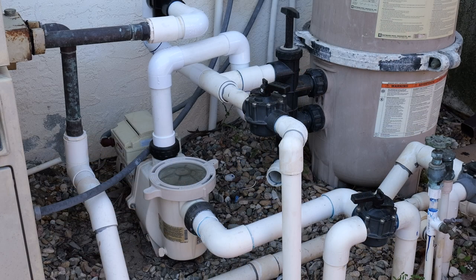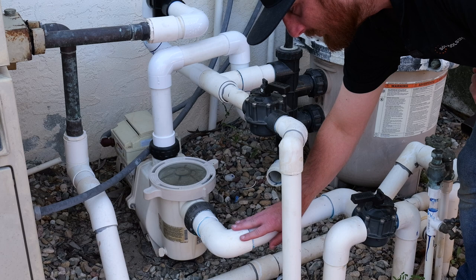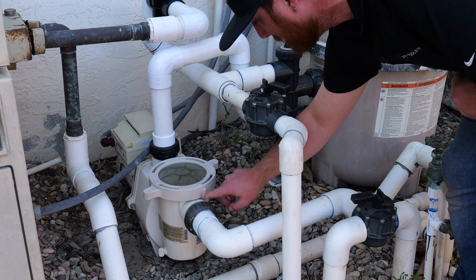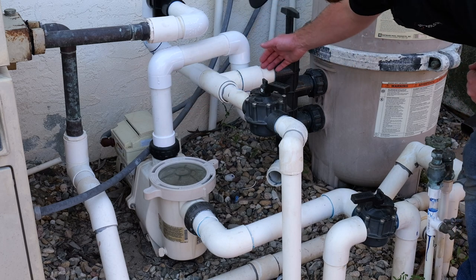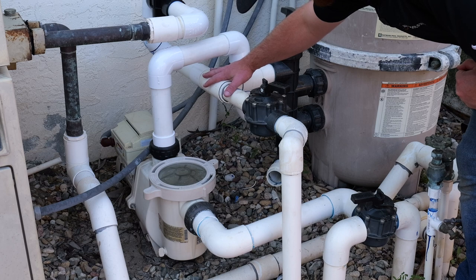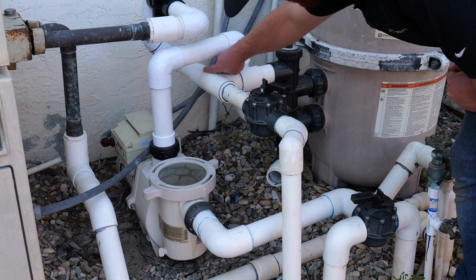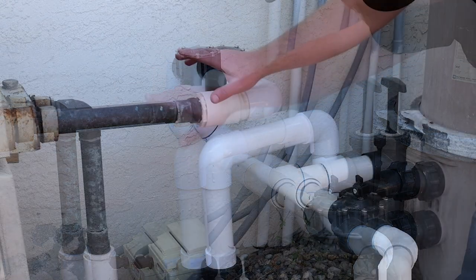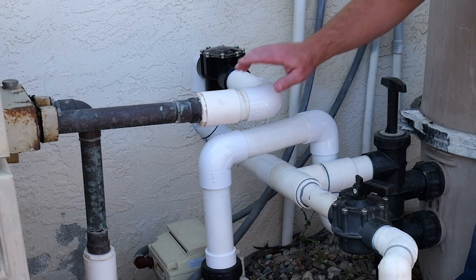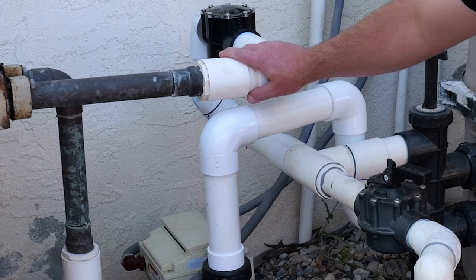I'm going to give you a quick overview of the pool equipment so you know exactly what pipe is what. On the front of the pump is your suction side — it takes water from your pool or spa, goes into the front of your pump, comes out the top of the pump, and goes directly into your filter. From the filter it comes out, and for this job there's a T fitting — one pipe with a valve is for a water feature, so we're not discussing that. Our main focus is this pipe here. After here, it goes from the filter to your external gas heater. If you don't have an external gas heater, no problem — this is the pipe that goes from your filter back down into your pool. That is exactly where we're going to tie our solar into.